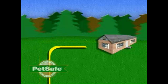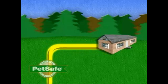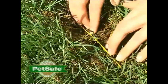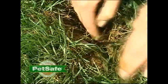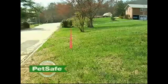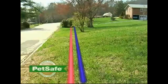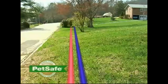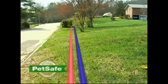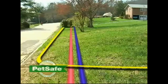Be aware that the wire will produce a signal from 2 to 12 feet on either side depending on how you adjust the setting on your transmitter. Even though an in-ground pet containment system will only be buried 1 to 2 inches below the surface, you should contact your local utility company to mark any underground cables and wires on your property — in most communities, this is a free service. If you must cross underground electrical wires or buried cable in your wire layout, plan to cross them at a 90-degree angle, or be at least 3 to 5 feet away from the wire.